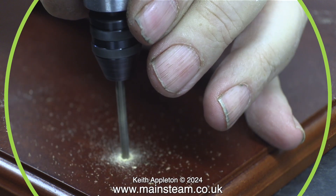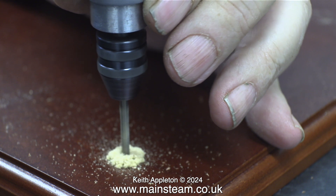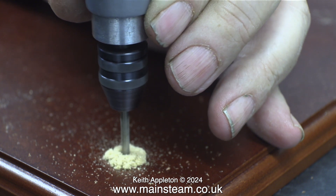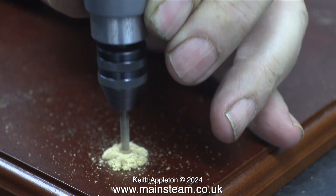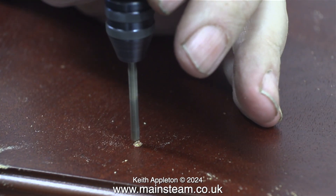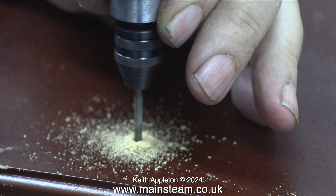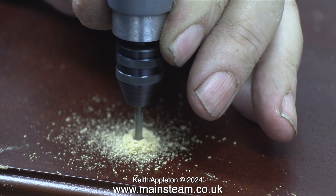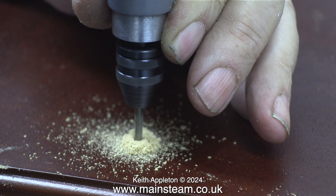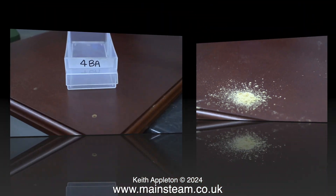This is a bonus for what I'll be doing later after I've drilled and threaded the holes. Don't run the drill too fast and don't apply too much pressure — give the drill bit time to penetrate the wood. In this opening sequence I'm showing the drilling of the holes in its entirety, unedited, because I want you to see how slowly I'm drilling. This makes for a much better job. If the drill is going really fast you're much more prone to making mistakes.